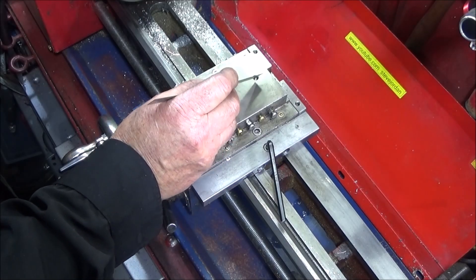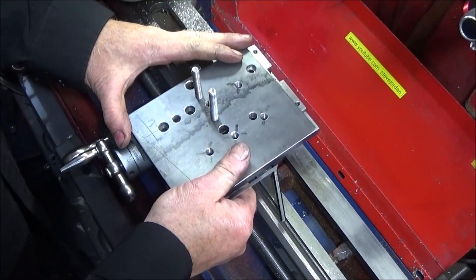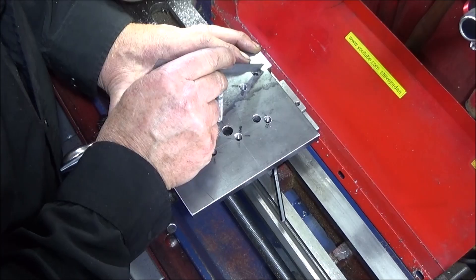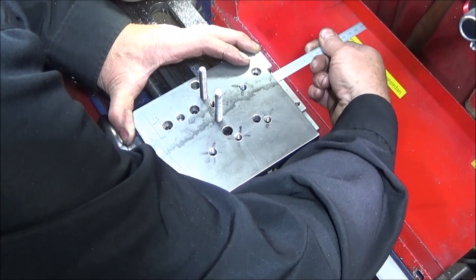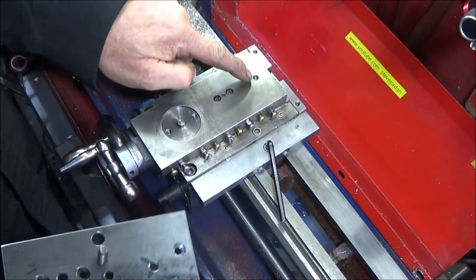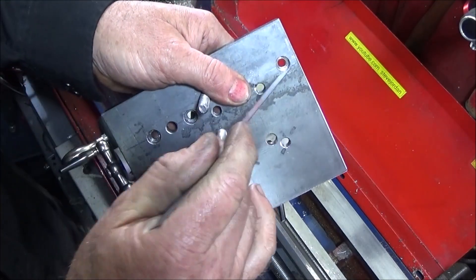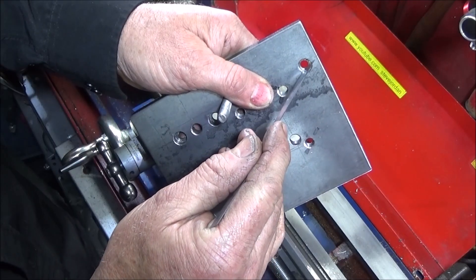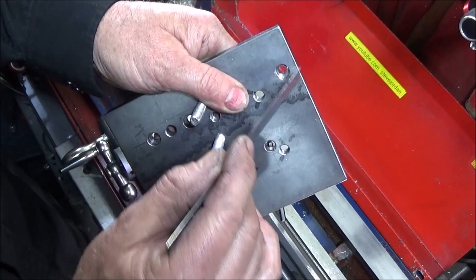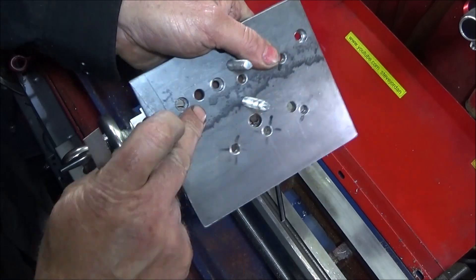To get this new six millimeter threaded hole in the correct position I took the carriage off the lathe, put it on the bench drill nice and square, bolted this one on without the two studs in here, and marked it up center to the actual gap in the carriage for the lead screw. Then I drilled down through, took it off, drilled with the core diameter, and tapped that one to six millimeter. On the top I drilled down to a certain depth with a 10 millimeter drill and then a 10 millimeter end mill down to the shoulder until the six millimeter Allen bolt head is below the surface.